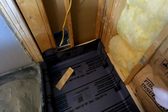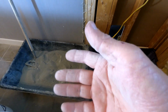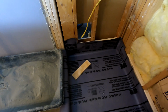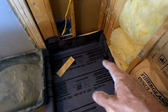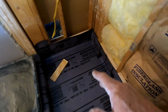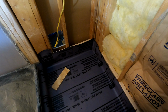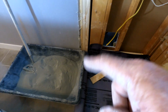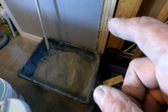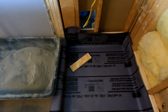Insofar as pouring the mortar, it's kind of a misnomer, we don't pour mortar, we just scoop it in here. And this is just shy of 3 feet. I think it's 32 inches or something like that, but I'm going to call it 3x5. A tub shower conversion is typically 3x5. It's how much tile I'm going to get anyway. So generally speaking, I get away with 4 bags and a fifth one just in case I need it. The drain barrel goes up.